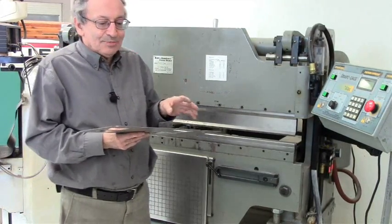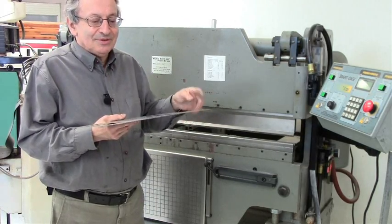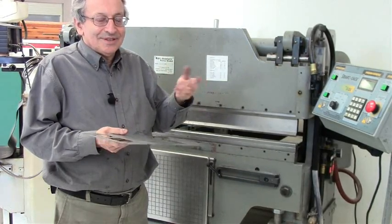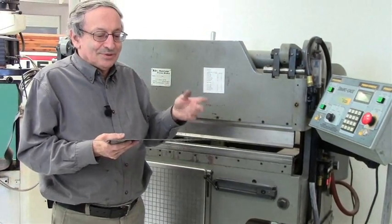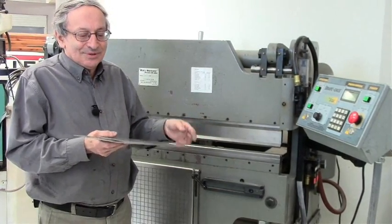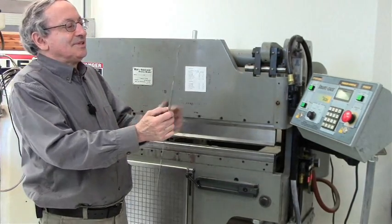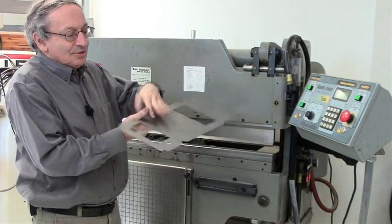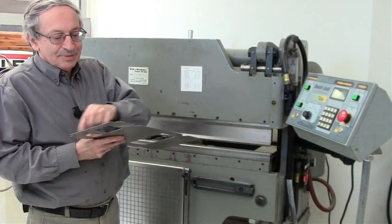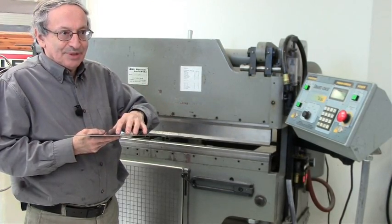The second very important thing: unless the part is symmetric, you have to bend it on the correct side, because you'll get a mirror image. That is the most common mistake — you look at it, bend it, and then you realize it's a mirror image and there's a lot of straightening to do. So think through what you want: you want a box that ends up with the switch on this side, so you want to bend up this way. We'll bend the periphery first, and then make these two bends — that's the only order you can bend this part.